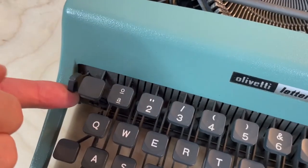To set a tab, push up. To clear a tab, push down. Suppose you want to set a tab — hit your space bar until you come to the desired position on the carriage. Push up and that will set a tab for you. Five more spaces, push up — that sets another tab. To clear those tabs, go to the beginning of the carriage, hit the tab key so the carriage slides to the first tab spot, use the same lever, but this time push down — that will clear the tab. Go to the next tab, push down. It's a beautiful, ingenious invention — on all Olivetti machines I've ever seen: the Lettera 22, the Lettera 32, the Studio 44.